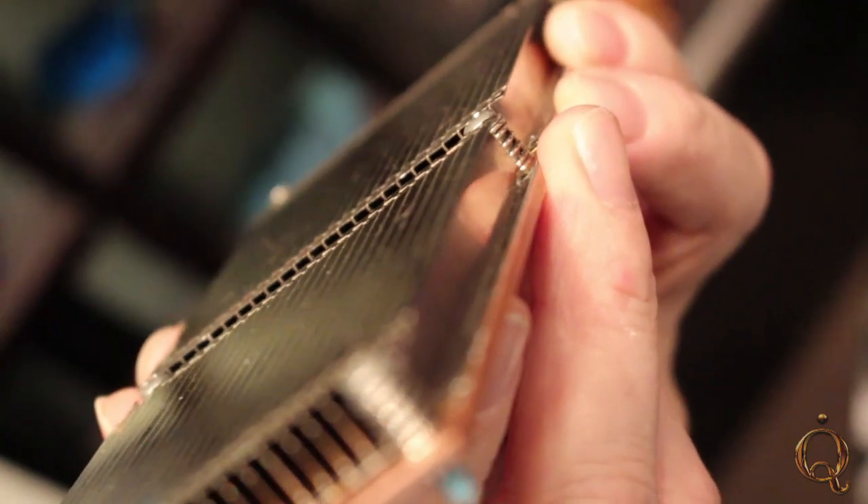When skiving, we can skive aluminum and copper. A copper heat sink that's skived is very heavy. One of the benefits of a zipper fin heat sink is we can have a copper base that gives us heat spreading — kind of like this one — and an aluminum fin profile which reduces the weight significantly. So we can combine those materials.